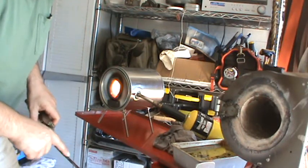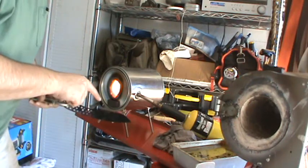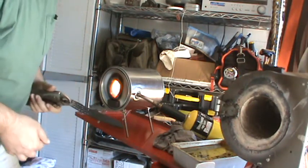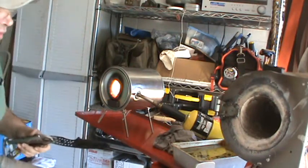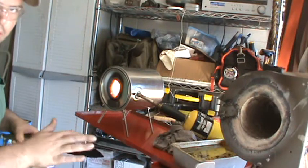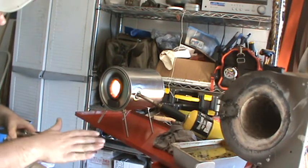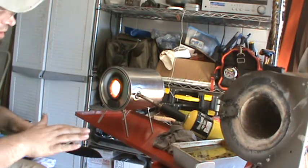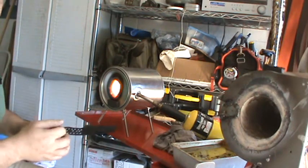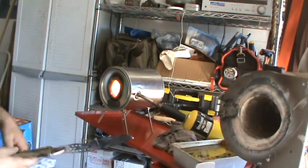I'll have to file-check it and see if I got it fully hardened all the way. I especially want to check this area right in here where it's thick, to make sure I was up to temperature. When I file this edge I'll be able to tell exactly where the file will bite and where it skates. If the file bites into it, then I'm going to have to re-harden it. But I think it should be good — we'll see. That's how you do it.